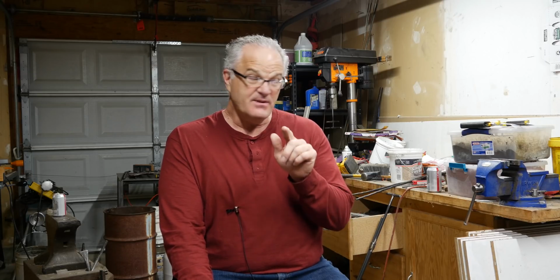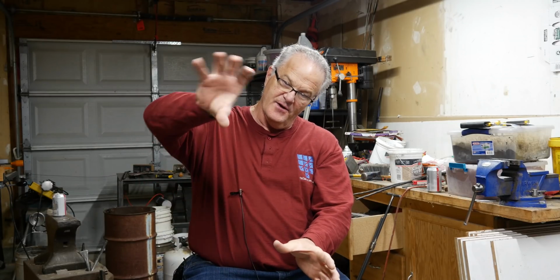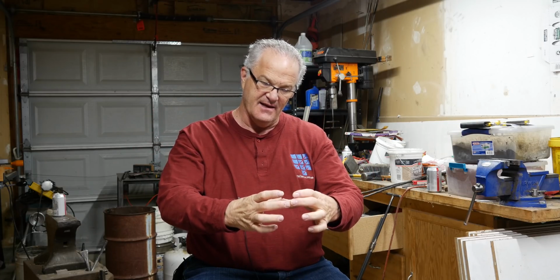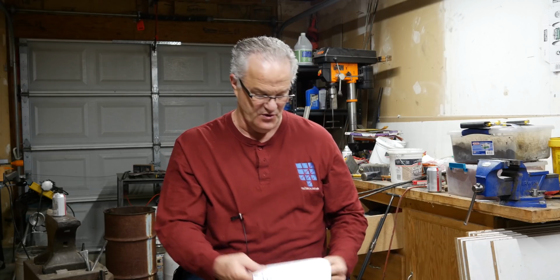But something to keep in mind, you see tall sprues, you see wide open sprues, right? And metal coming down. That metal is coming down really, really fast, especially when you consider the pour height. When you pour it out of the flask, and there's a gap, and then it hits that tube, which is unrestrained, it comes down. You could be way up there, at 2 or 3 or 4 meters per second at that point, because it's accelerating as it goes down. So that's a big deal. That's something that I try to do, and I think this is one of the ones I do right. But we'll talk about this when I get into rule number 2.